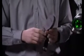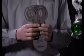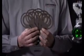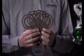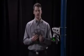And so the last thing we're going to do is use our system test film to ring through an alarm in the system. Now these test films look just like gas to our LS2000. It's because they're constructed of a hydrocarbon material that reads to the LS2000 just like a gas cloud would. You can see we have 5 identical films in here.